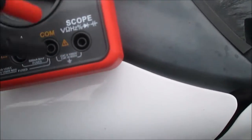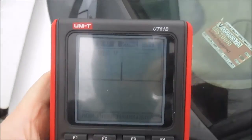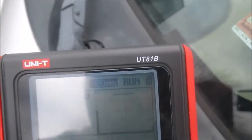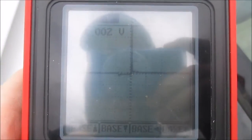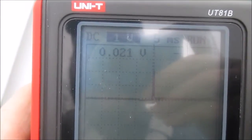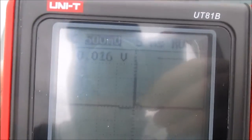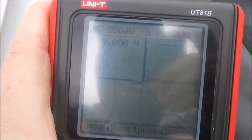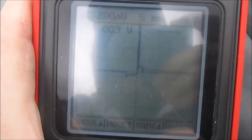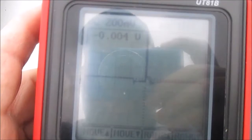That's how you change polarity on these — pretty easy. Some lab scopes have an invert button. I'm going to change the time base down to about five milliseconds. Starting to be able to see it. I need to change my range — I'm up at one volt, going the wrong way. Starting to see the pattern — about 200 millivolts looks right.